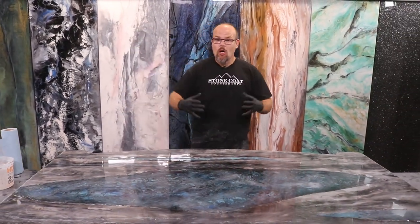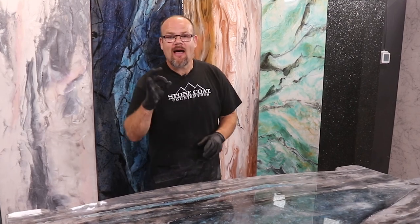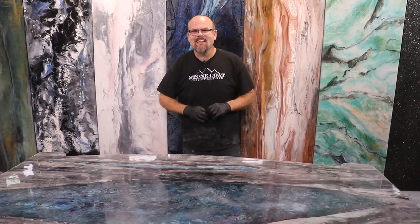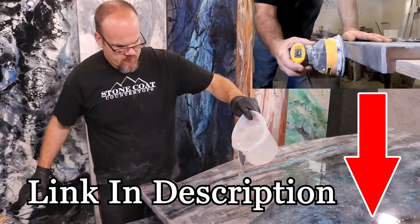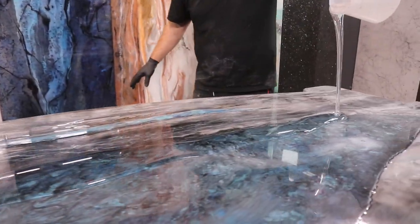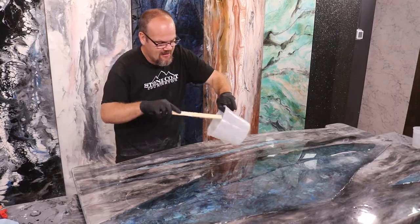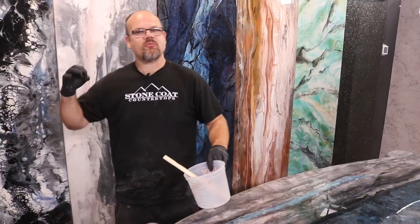It's okay if it's warm — keep it nice and warm. Epoxy will set up gradually and you've got plenty of working time. With this second clear coat I'm going to trowel it, chop it, torch those air bubbles out, and leave it alone. I'll look for imperfections and pick out any dust nibs. For the triple mix strategy: mix in the bucket with a drill, mix on the surface with the trowel, then mix one final time while chopping.